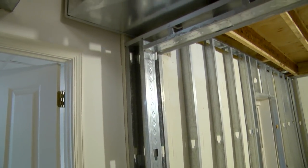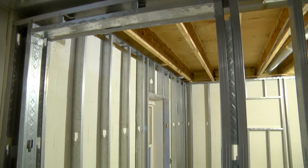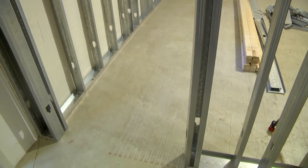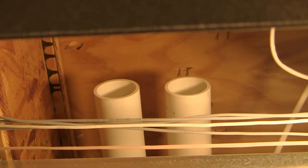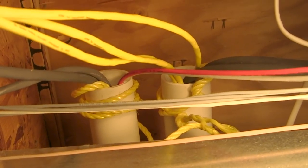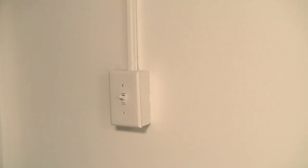Adding a second layer of drywall to the outside of our walls could get another few dB, but the cost didn't seem worth it. In any control room, there are certain penetrations through the walls needed to make the room practical. For audio and data lines, we used 3-inch PVC conduit that runs through the ceiling and down the wall inside the control room — about 35 feet of conduit between where it exits in the hallway and where it exits near the equipment. With two 90-degree bends, not much sound gets through, and once the wires are run, we seal both ends with acoustic sealing compound. For AC wiring, just two small penetrations were made in the ceiling drywall and caulked with special acoustic caulk.